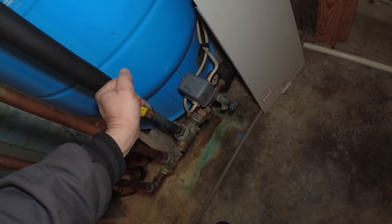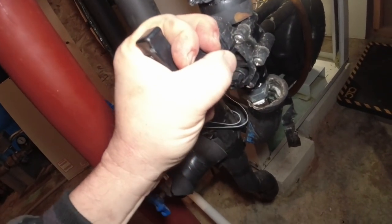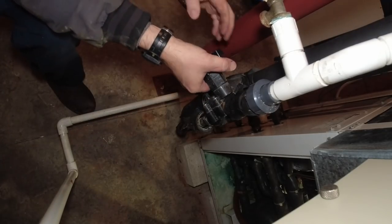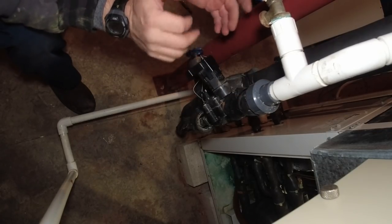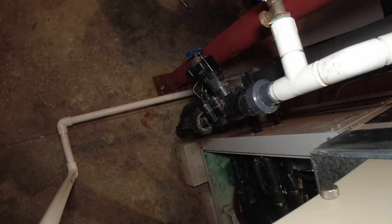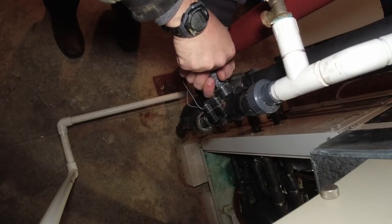Here's the line for it - yeah, that stopped it. It's just a waste, total waste. On is to the left, off is to the right - but if you don't know which way you already are, let's see if you can get it off. You know what, let's shut the water off first. I do not like these valves anyway. I like the Taco valves that close slowly - these here have a tendency to slam shut and then it'll make the pipes jar.